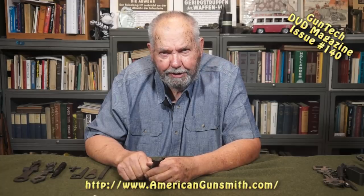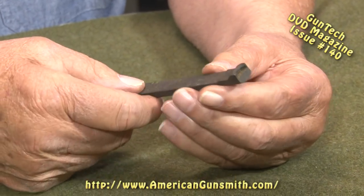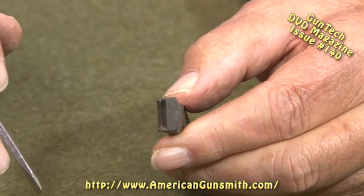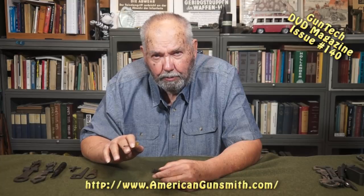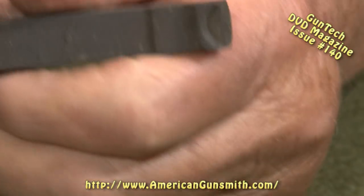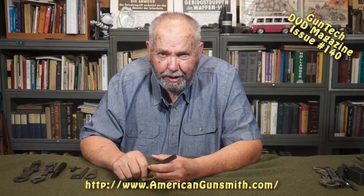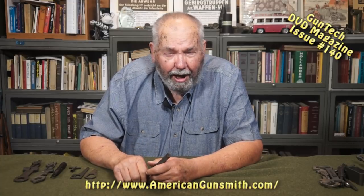The next gun, the M73 and the M219 — when they worked — you had a broken shell extractor, and this one is kind of unique. It depends on the rims staying on the round, so it's useless if you have a case separation. It only works when you've got a partial problem with the chamber or the extractor broke. This fits over the back of the cartridge case on the rim and allows you to lever the round out of the chamber. I don't know how often it happened on an M73 and M219 — I only had a little exposure to those guns.